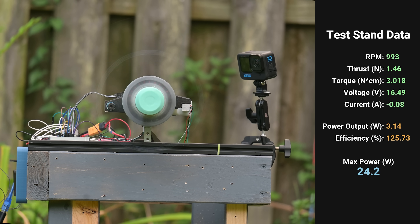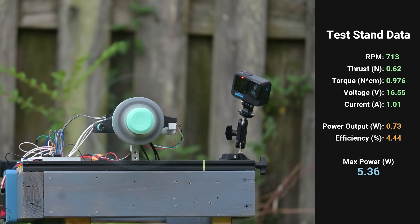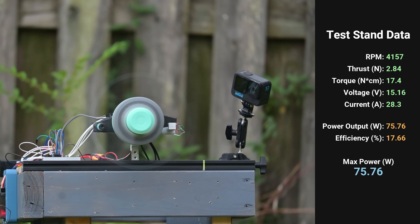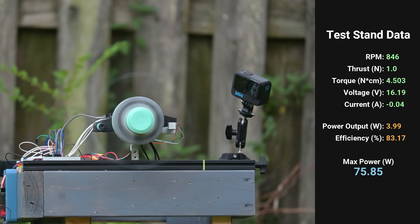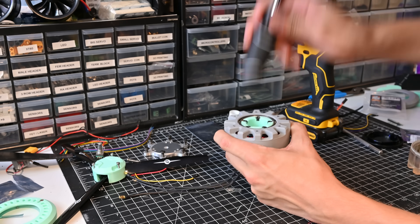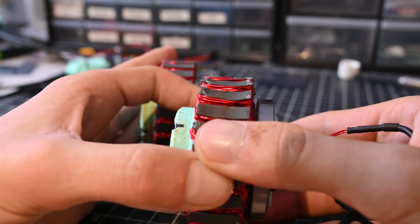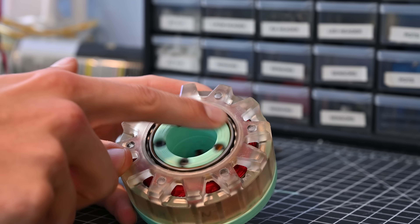With this setup, the motor only output about 25 watts of power — definitely a lot less than I was hoping for, though I think it's certainly capable of doing more. I'm thinking a different winding pattern or maybe a Halbach array for the magnets would help. I did also test winding the core with two wires in parallel with half as many turns, and this generated more power at 75 watts, but the stator got really hot due to less resistance and the core pretty much started melting — so that winding layout really doesn't work. I'd love to hear your suggestions for making this a better performing motor, and I definitely plan on continuing to iterate on this design. Leave a comment below if you have any suggestions, subscribe for more, and I'll see you in the next one.